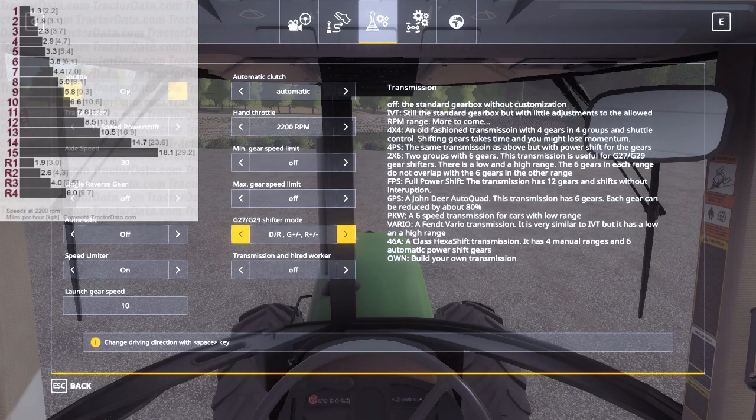Let's open up the VCA panel. The 15-speed power shift was offered by John Deere from the 4450 up to the 4960, then it was discontinued and split into two different transmissions. The 8000 series — the successor to the large frame Sound Guards — got a 16-speed power shift, and the 7000/7010 series — the successor to the small frame Sound Guards — received a 19-speed power shift, which is very similar to this one.